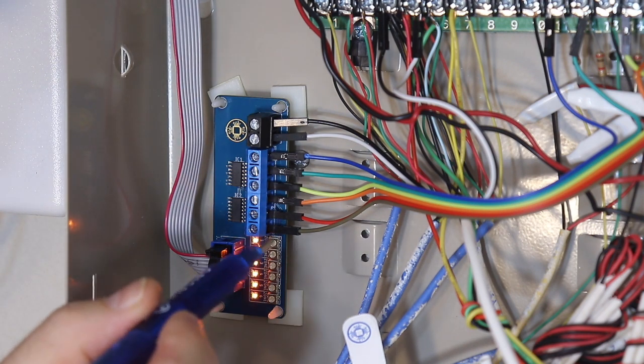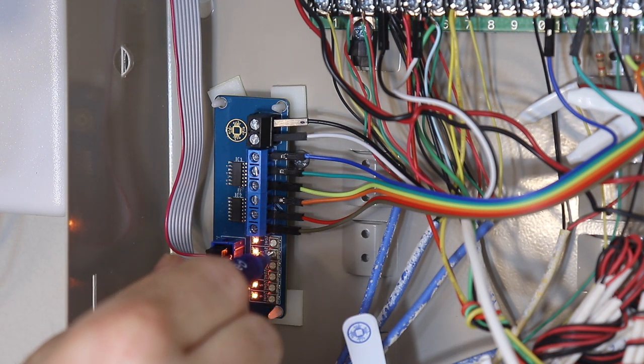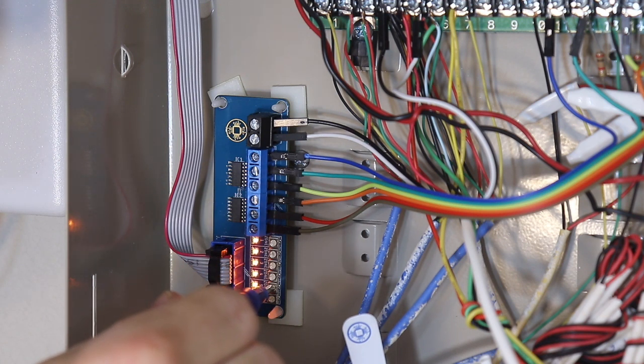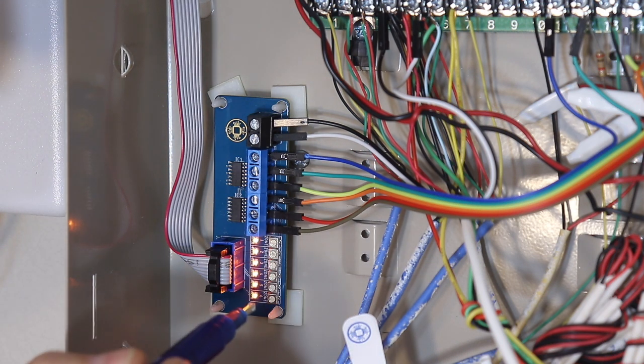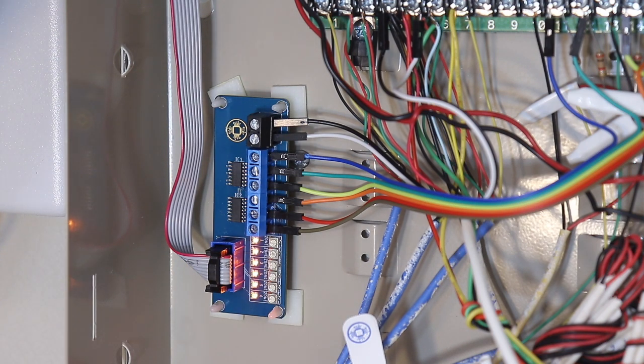So typically the way we do this is we're going to just tune it back and forth while knowing that the door is closed, and get right to that threshold where the light is on. And if it goes off, then dial it back a little bit so it's on. Now I'll have a partner go downstairs, open each zone, door and window, to verify that the light turns off when that circuit is open.